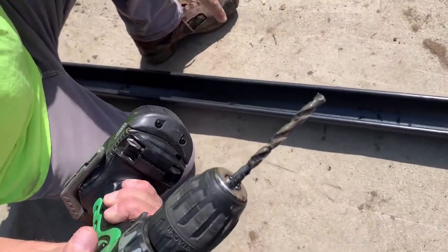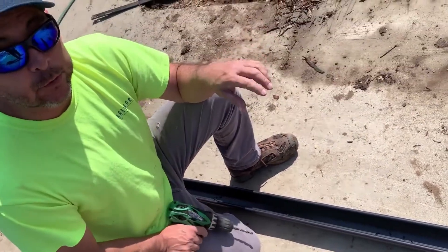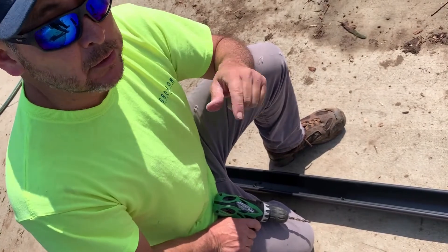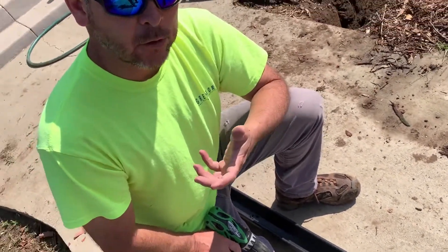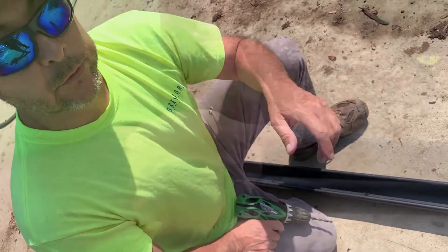There's a quarter-inch drill bit — the large orifices allow the water to flow through with all the soap, detergents, and everything else. Also, some soil will go into the pipe, but after a while it'll coagulate and still allow the water to flow through. Soil is always porous, so whatever soil does get in the pipe, it'll still flow through.